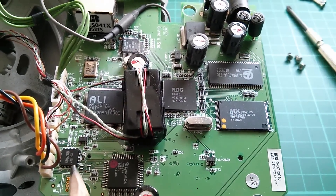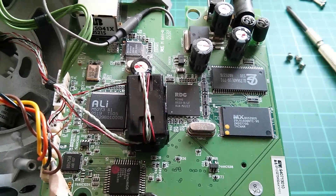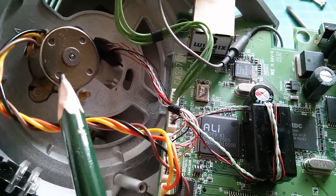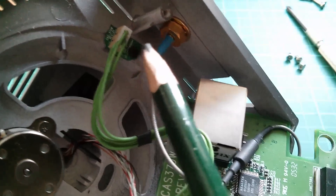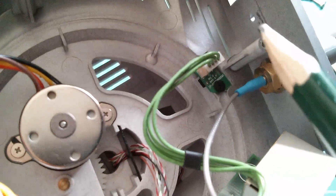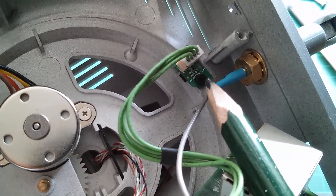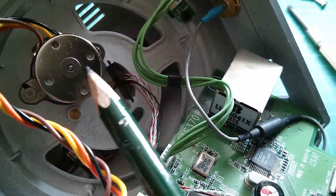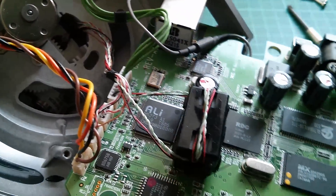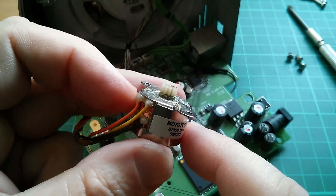I'm not sure what these are, but that one looks like it might be a motor driver — it's near the connections which go off to the motors. This coloured cable goes to the main pan stepper motor. Interestingly, up here there's an optical sensor. The pan mechanism isn't just being banged up against its end stop — it's actually going to an optical sensor to register the zero point. The motors look really nice quality. This is the pan motor — a stepper motor, a Moto Tech.